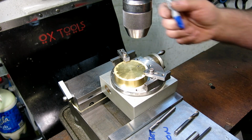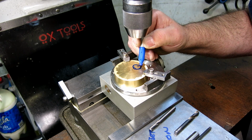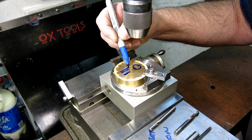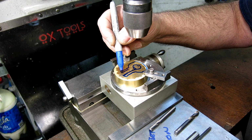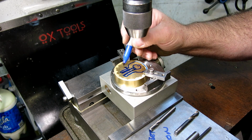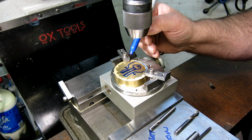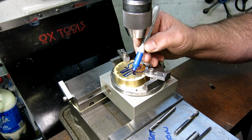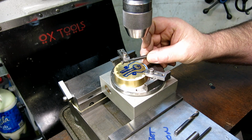All right, we're all set up here on the rotary table. So there's our little center point there. So there's going to be a hole here, and then a slot, and then our thing comes up and goes around, something like that. That's a loose interpretation of the clamp. So we've got an arc center here, we've got an arc center here, and then clearly one there. So basically we're going to mill this profile and then these straight sections. And so there's an arc center and an arc center that happen to correspond to this diameter here.